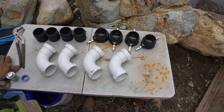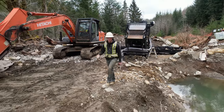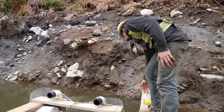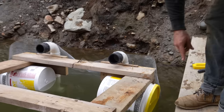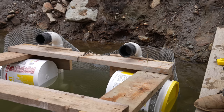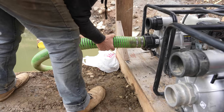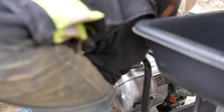There's all four elbows — we'll let them dry. Now the next thing is to hook up our pump pickups to the floats. I put a screen on here so that as it draws material, sticks and debris get caught on the outside of the screen and not sucked into the pickups for the pumps. The roll was a lot less than I thought — only about five or six feet. So now I've got to switch a couple of new ends on these pickup lines so they've got cam locks on both sides, and then it's just a matter of snapping them on and hooking them up to the pump.